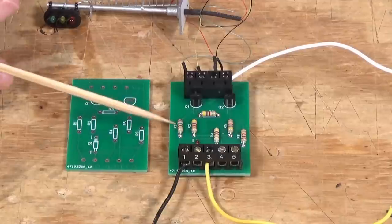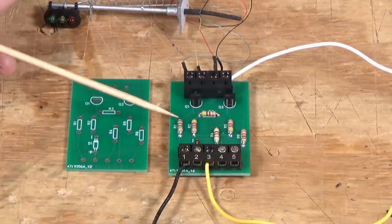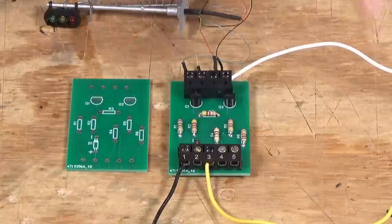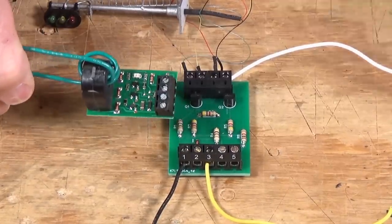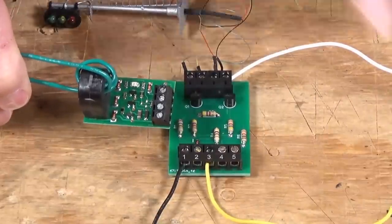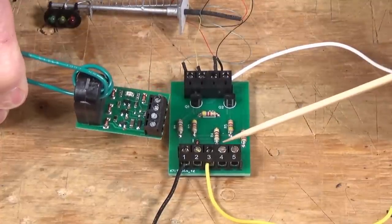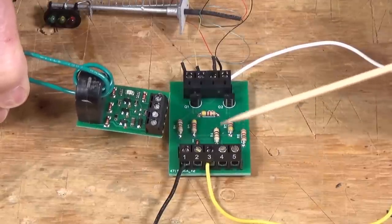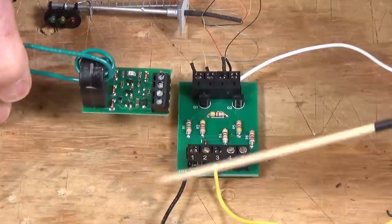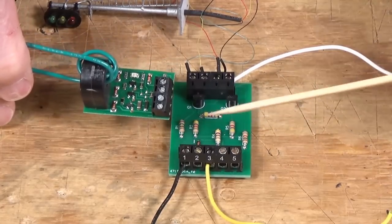One thing I'll point out: I did end up replacing the value of R1. It was originally supposed to be something like 470 ohms; I had to increase it to a value of 750 ohms. I'll include that in a drawing of the way it's all set up and wired, which I'll put on my website — link in the description. I did not cover the full wiring for the actual detectors. What you're doing is using the detector to throw a switch and feed 12-volt minus to the detect in terminal, and that minus 12 volts kicks in and gives you a red or yellow depending on where the detection is.